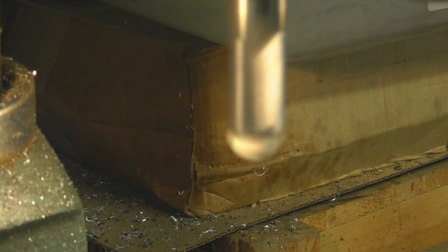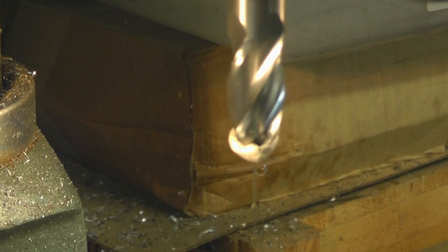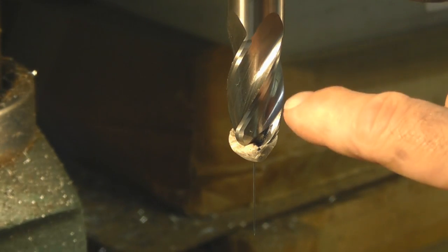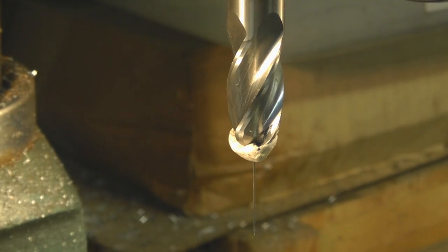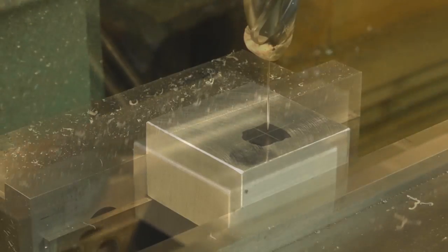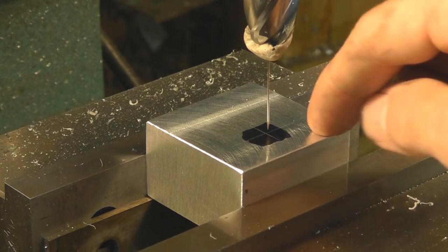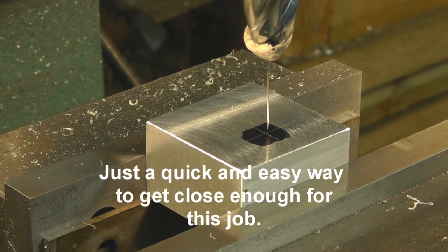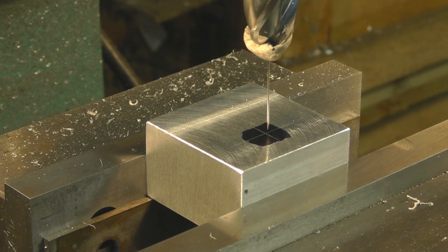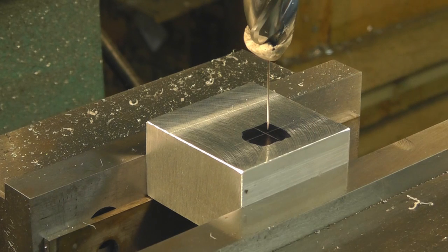You turn on your milling machine and touch the needle until it's perfectly centered. The tip of that needle is now perfectly centered — it is turning exactly on the center axis of this three-quarter inch end mill. I'll adjust my table in and out, left and right, until we're dead on the mark that we scribed on our mold block, and that'll put our end mill dead center on the mark. We'll do the same thing with all four blocks.